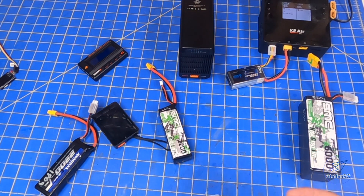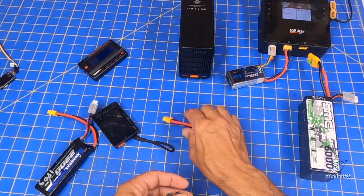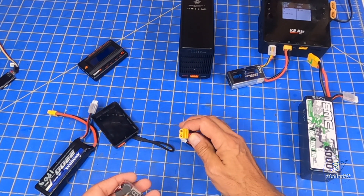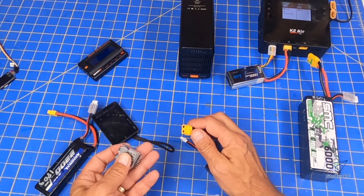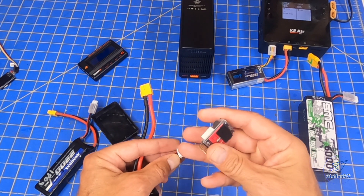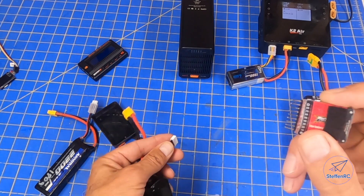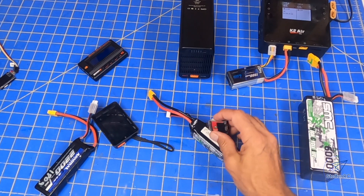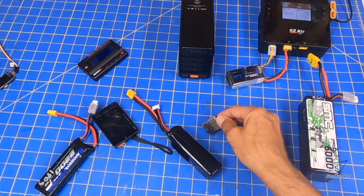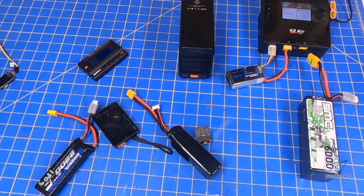The other thing you can do — and I know people have done it — is make systems where it's discharging through a light; it illuminates the light and sucks the battery down. When those are in play, you do need some kind of system that will give you an alarm, like this guy here. If you plug that in and set the alarm for 3.8 volts, once it gets down to that 3.8 level, this thing will start chirping and let you know that it's now at a storage charge.